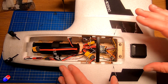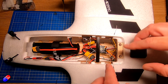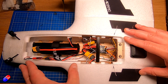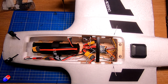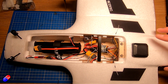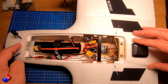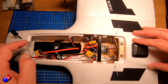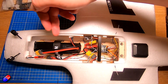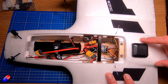So that's how it's all laid out. Centre of gravity is really good. Personally I'd put the flight controller a little bit further back if I was doing this again, just to get it as far back as possible. The weight of the battery has to be pretty big. I'm hoping that if I do put a pan and tilt on here when head tracking becomes available on Walksnail, I can hopefully use a slightly lighter battery - that's going to be about 24-25 grams of weight in the very nose, which probably means I can get away with 60-70 grams less of battery.